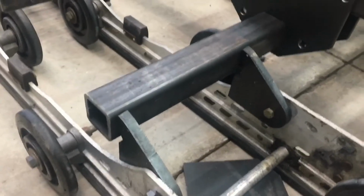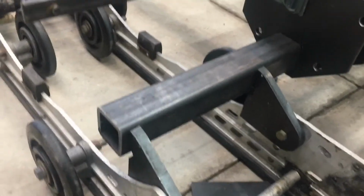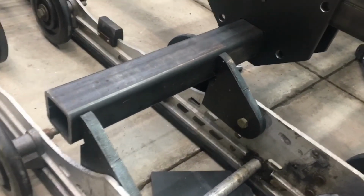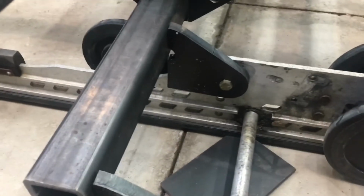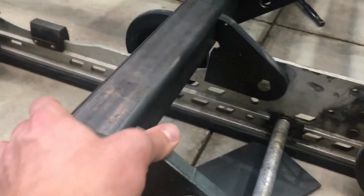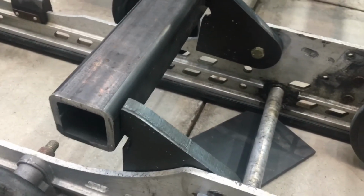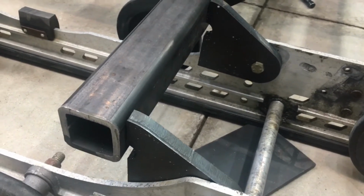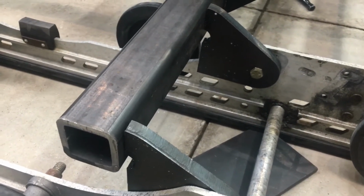Well, sometimes things just work out perfectly without even trying too hard. So I cut those triangular pieces in half and bolting them onto the rear slider there. I can just get this welded right around, and it's going to make a really nice way to attach the track slider to the chassis now.